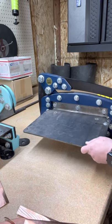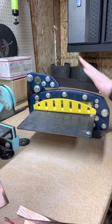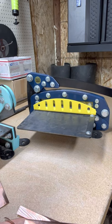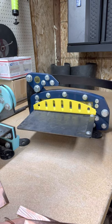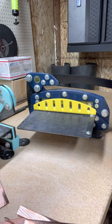On the 12-inch, you'll notice right away that there is a blade guard attached to your shear - I don't have mine on right now. This guard is designed because on the 12-inch, all the weight rests in the very front. The guard is to protect your fingers and keep you from sticking them underneath the blades. On the off chance you have a fairly loose handle like I do - because this is a very well broken-in second-hand shear - if the handle comes slamming down, it keeps your fingers out of the way.